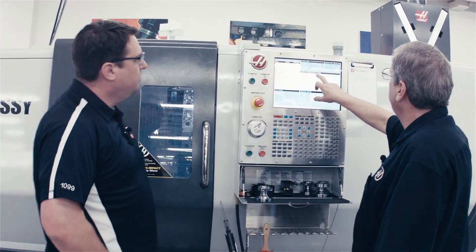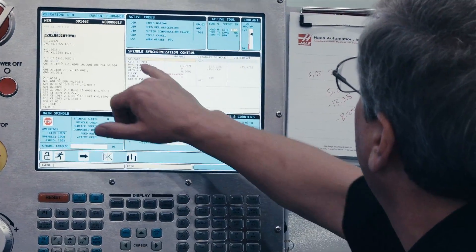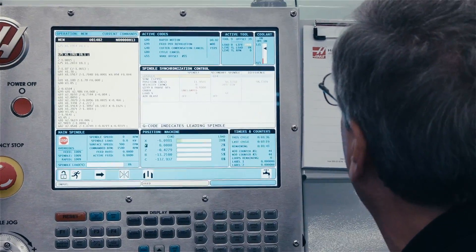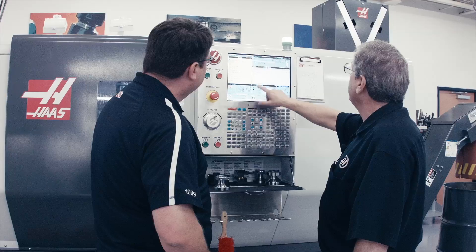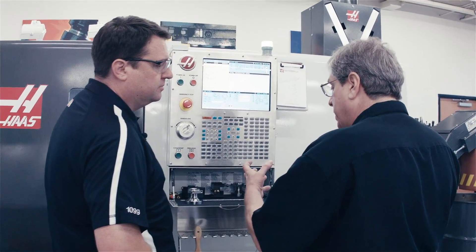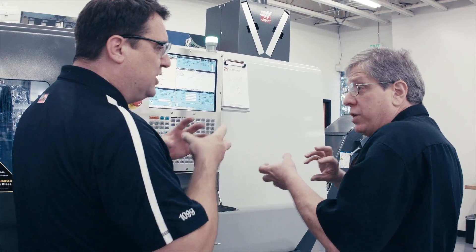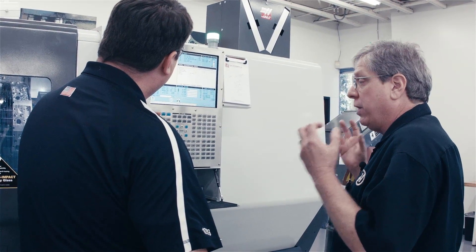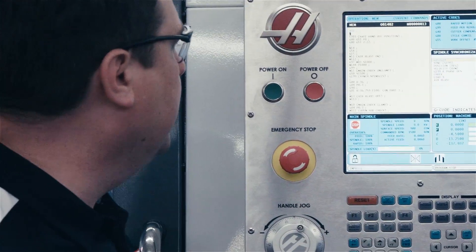Here's our spindle synchronization control page. What this does is tell us the status of both spindles — essentially whether we're in G14 or G15 mode. We're machining on the secondary spindle now, so we're in G14 mode. This is giving me the position of the two spindles; this one's the only one running at this time. And then we've got this phase offset, which is an R-code. If I needed to offset the orientation between the secondary spindle and the main spindle for hex stock or milled features that need to be timed — to make sure they line up — I give it a phase offset and they'll stay synchronized at the proper orientation. So I can clock that spindle how I need on exchange.